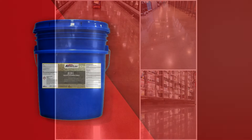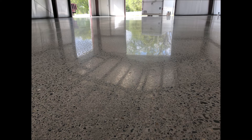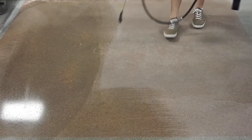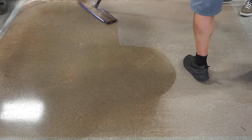The next is 3DSPE. It's also a breathable product, but this one is semi-topical, so some of the product wants to stay on top. It protects against stain and etching, also has UV stabilizers. It also contains 3D densifier to enhance concrete floors with your dye or stain, so it has a little densifier mixed in with it.